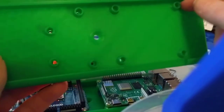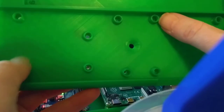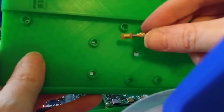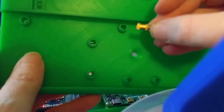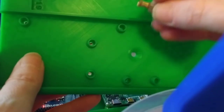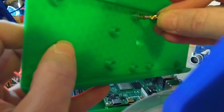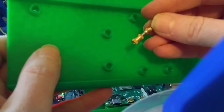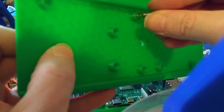These little standoffs at the moment aren't threaded. I'm not going to thread directly into them because that would damage the plastic, and if you want to take them out again you're probably not going to get a very good bite on the screws later on. What I am going to use are these little brass inserts. The way you use these is you heat up your soldering iron, stick them on the end of the soldering iron, give them 20 seconds, and then push them in very carefully and very straightly into the holes.